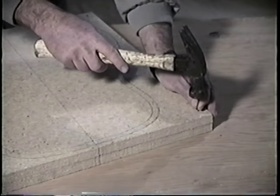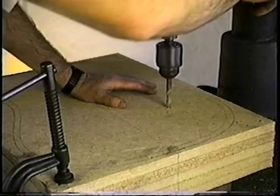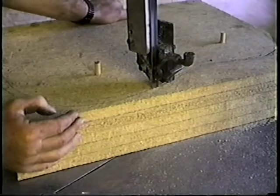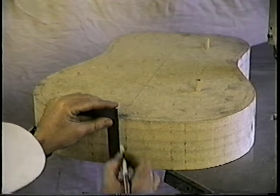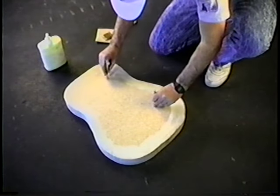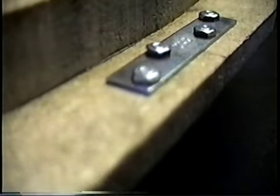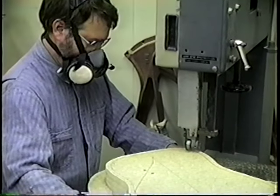After aligning the boards, we secured them with nails at the corners to prevent sliding when pressure was applied. Once the glue set, we lined up the two stacks and drilled the boards to use three-eighths inch dowels for alignment. The boards were sawn out on the bandsaw using a three-eighths inch skip or hook tooth blade, and the form now looks like a large version of the guitar body. The center line is redrawn on the edges for alignment, the dowels removed and stacks separated. We then spread glue, replaced the pins, and put the larger board between the stacks to give the form strength and allow clamping in a vise. We added a bracket to allow the bandsaw to enter when cutting out the inside.